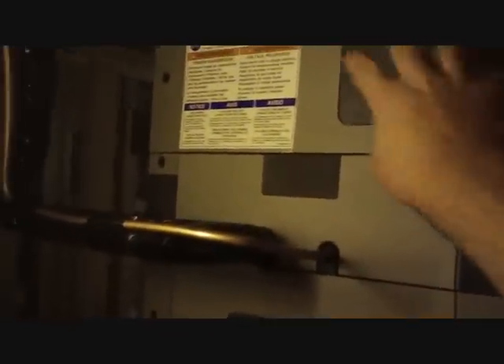Those are the refrigerant line connections — they have to be out of the way of the heater so you can pull it out if you need to. You also have to be able to take this door off, and the drain has to be far enough back so you can take the coil door off. That's where you access the EEV and the sensors and things like that. The next thing I'm going to do is wire it up voltage-wise, so I'm going to go through the manual and make sure I've got everything straightened out.